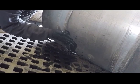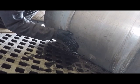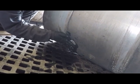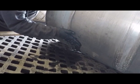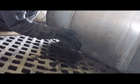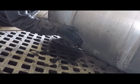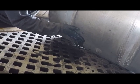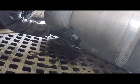And now he just kind of made it into a little putty, and he's just kind of pushing it on there where it's flat. Just going to hold it for a couple of minutes. Now, if you had 100 gallons of fuel in there, a little pressure, you might have to hold it a little longer. I don't know, but it definitely seals up, even though it's a dirty tank, it's bent, and there's fuel there.